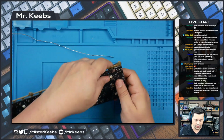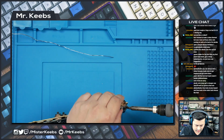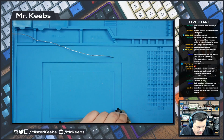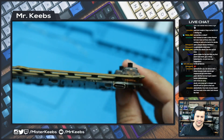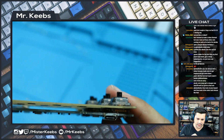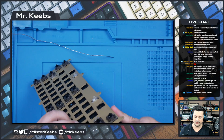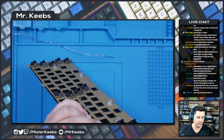So that's when you should come here, touch the solder joint that you did, and then just press the PCB until the switch touches the PCB, and then let it go, just like frozen. And then if you look again, you can see that now it's really touching. It's really hard to tell from this view, I guess, but you can see that it's now touching the PCB. You can also look from the side and make sure that the little nub is touching the PCB.